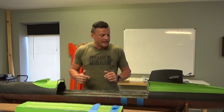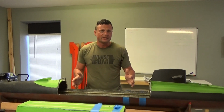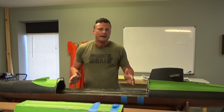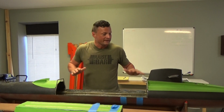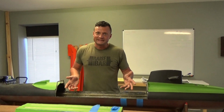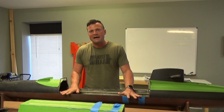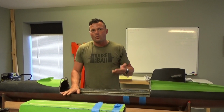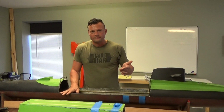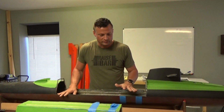And so what I would actually recommend is a centralized ballast tank, one ballast tank, and you would need to calculate the size of that based upon your best guess as to the weight of the hull above the surfaced waterline. Just as an aside for everybody who's not familiar, really the only purpose of the ballast tank is to lift what you want out of the water. That's the main purpose of it for the purposes of a remote controlled submarine.